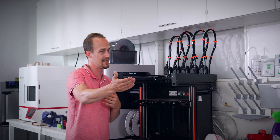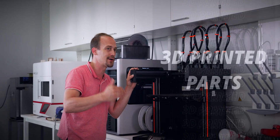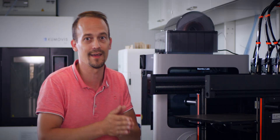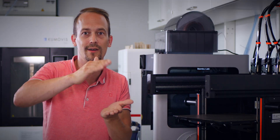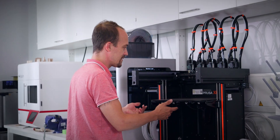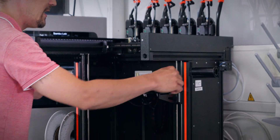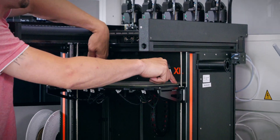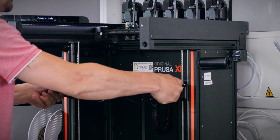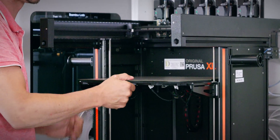What I personally don't like — and I said it in my last video as well — is using 3D-printed parts on a 3D printer, because tolerances stack up. If you use an imprecise technology to manufacture something that should in turn manufacture something precisely, you stack tolerances up and up. It's like doing a copy of a copy of a copy — it gets worse. Also, they put the movement of the print bed on only two axes with industrial slides, and that just makes the whole thing a little wobbly. They did a great job with a strong aluminum part below to keep things stiff, but in reference to the tool head, it can still wiggle and move.